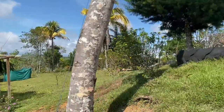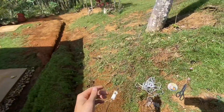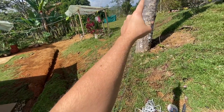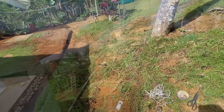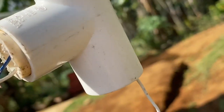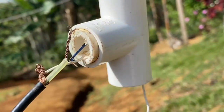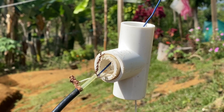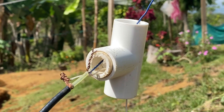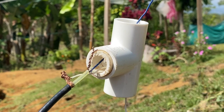Hopefully the takeoff angle will be much improved. Maybe I can talk to people in the States and to my friend in town, because the lobes on a dipole come off on the sides — you won't get very much signal traveling off the ends of the wire. I'm going to tape these wires off here, put them inside this T-connector, and hopefully we'll be set up with a very basic but usable dipole antenna, completely improvised and almost free. It's necessary to improvise here in Costa Rica because good luck getting radio parts.